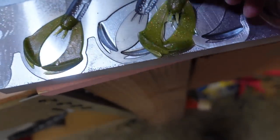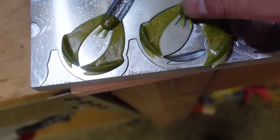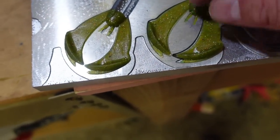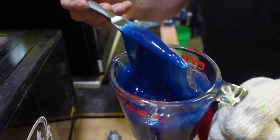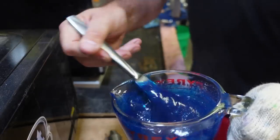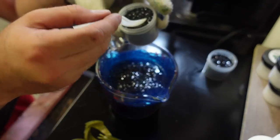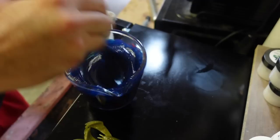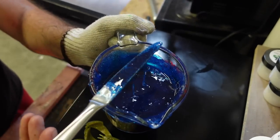Next, we've got to get the head pieces added into the mold. When you put these in, you have to be really careful that you get every little claw piece, all the antennas — everything put in there and lined up. Because if there's any gap when you put the mold together and shoot the plastisol, it'll have a space and it won't shoot nice and pretty. Now to get our blue body color mixed up — that's definitely blue looking, maybe a little too blue. I've got an idea: add more blue — it should make it darker. That's darker but I want to darken it up even more, so I'll add a couple different sizes of black glitter: a 0.015 small and a larger 0.040.